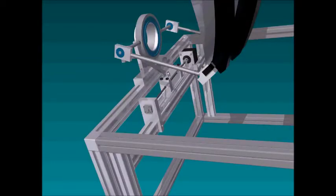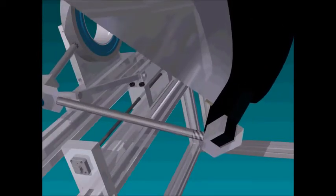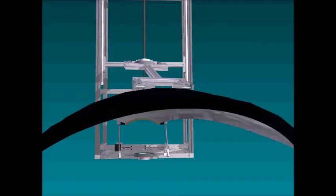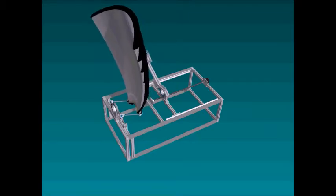At the front, it's a pretty similar setup. The motor rotates, the lead screw also rotates, and a threaded nut pushes the assembly to the left and right. The only difference is that the assembly is a lot more complicated than the rear one, originating from the fact that the focal area needs to be left free from any obstruction because it gets really hot when sunlight gets concentrated on it.